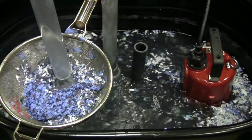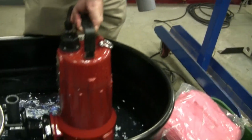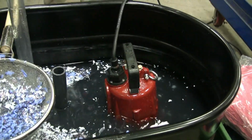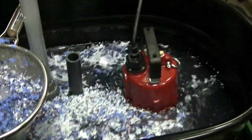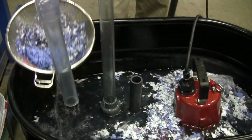But this pump is self-priming, so you cannot airlock this pump. That's another neat feature of it. The impeller is very, very close to the suction inlet, so you can't airlock it. I'll just show it to you now. What I could do is let the air trap an air bubble. Okay, so I just let the water out, and it got air inside the volute, and it's evacuating the air, and it starts pumping. It's another feature that we designed in, so it doesn't airlock.